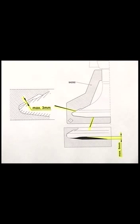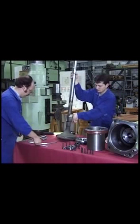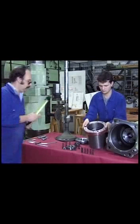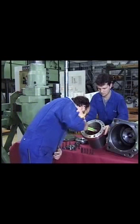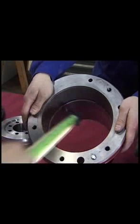Please note that damaged or worn down Nimonic valves can be reconditioned. Such work on Nimonic valves may only be carried out by specialized Wärtsilä NSD reconditioning centers. The air cylinder is also carefully inspected and measured.